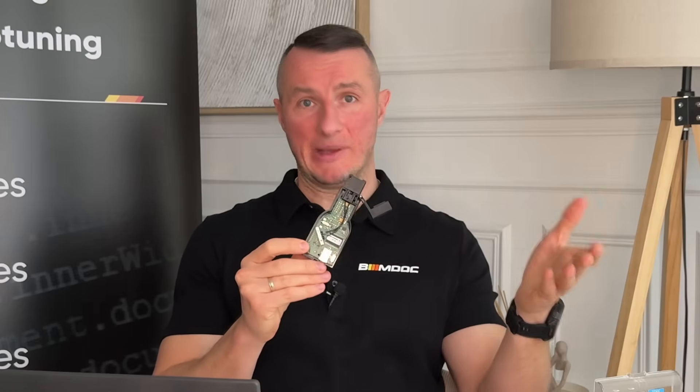Among the tools I use, the majority are original, but I also use some non-original tools. The main rule I want you to remember: never — and I say again, never — try a non-original tool on a client's car first. If you want to use a non-original tool, try it on your own vehicle or on a single ECU purchased from a scrapyard to make sure it works. Sometimes if you disassemble Chinese tools they look very similar to the original, just with cheaper components, and without an original to compare you won't notice the difference. The only way to test it is an actual real-world test on a car or ECU.